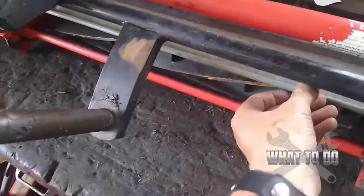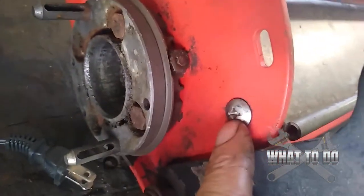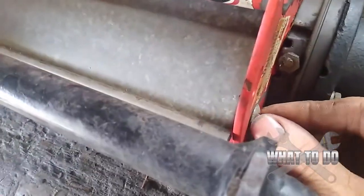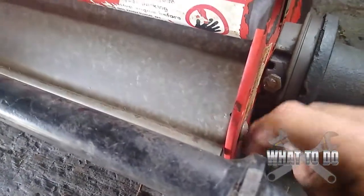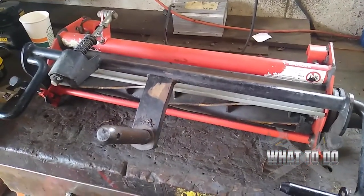We're going to want to get this shield off of here. The shield goes around the back. There's a Phillips head here and one on the other side, but underneath. There's a nut on each side, and I'm not sure what size that nut is. A lot of times these get replaced by prior mechanics and they use different nuts and bolts. I'm going to use an adjustable and a Phillips head to take that shroud off.